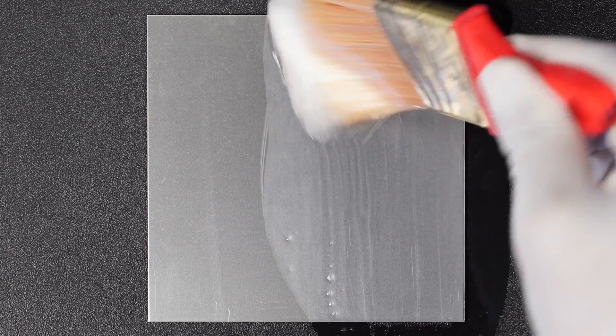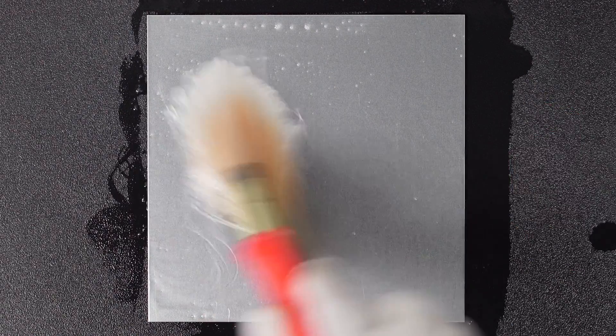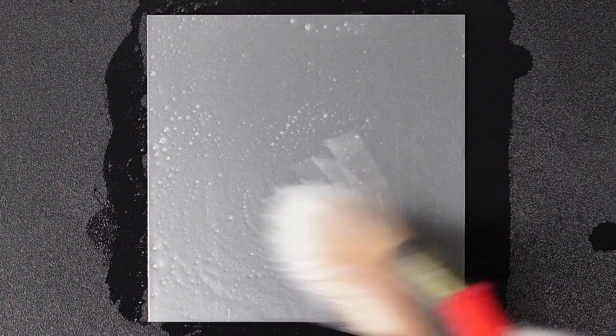On this piece we're going to apply Circlean 400 with a simple brush to descale and clean the steel. It's important to pay attention to any corners, edges, or hard to reach areas while brushing to ensure full cleaning of the surface.